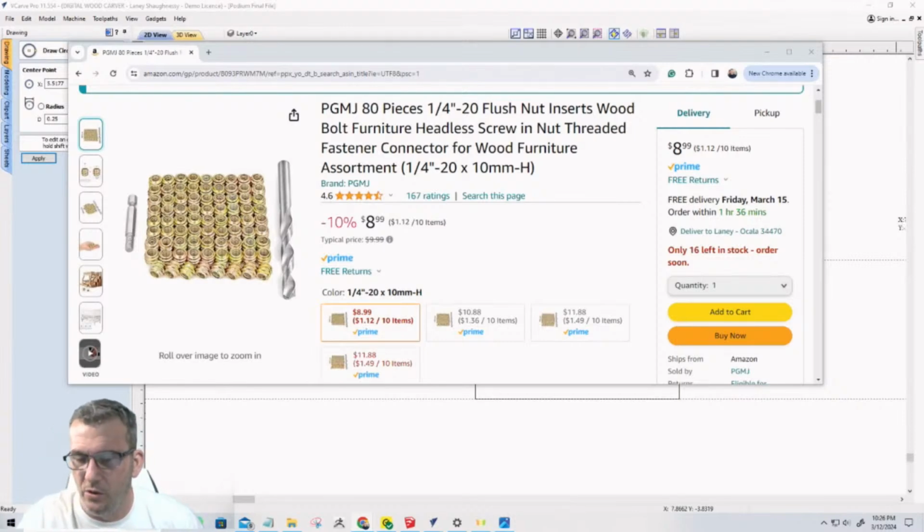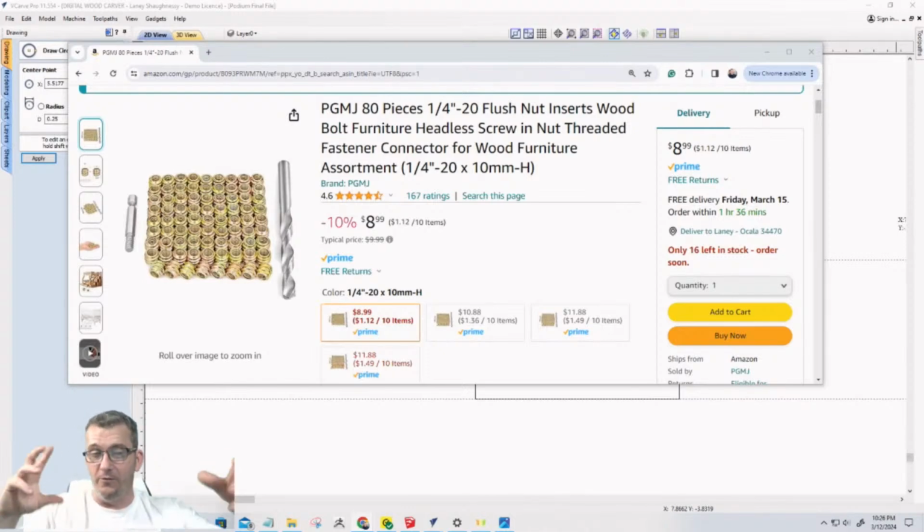I appreciate that. So JR says, I'm a chunky boy, as the saying goes, and that requires a friction fit that is guaranteed to slip a lot sooner than normal. Now if you're talking about the up and down on the rods, but if you're talking about the jig for holding the part to cut, you'll be able to get your 3 cuts out of it before it loosens up, because in the MDF you're going down 3/8 of an inch in your pocket, so it'll be pressed in there with good depth. But if you're referring to the knobs just kind of pushing in, if you've got your weight on it, like leaning on the desk or the computer, that's going to wear over time. So threaded inserts wouldn't be a bad deal, and these would be the ones that I would use.